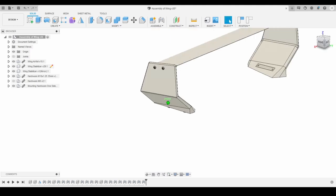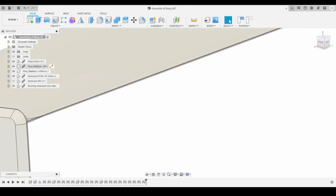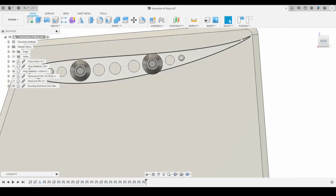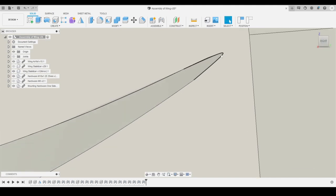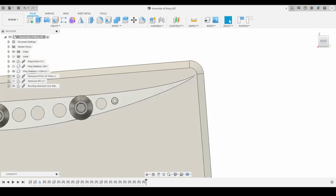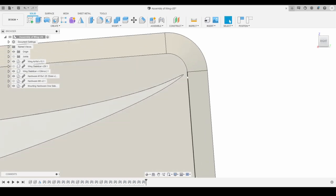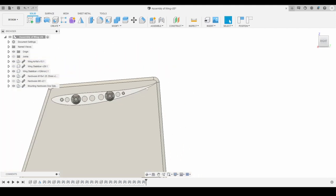And I also chamfered the back edge of this wing a little bit so it's not as sharp in comparison to what it was, because it was way out here and came down to a point. It still comes down to a relative point, but it's not as sharp as it was, hopefully to minimize how fragile it is right there. And when you lay the carbon, the layers will offset and make it thicker, so that should solve that problem a little bit more too.